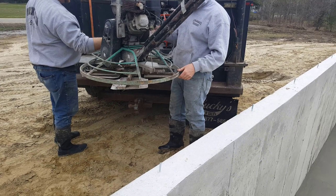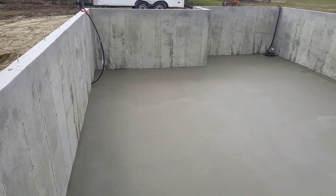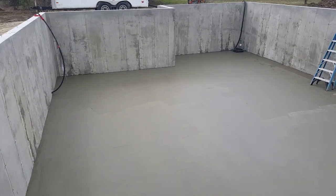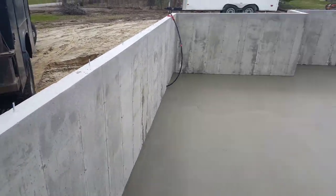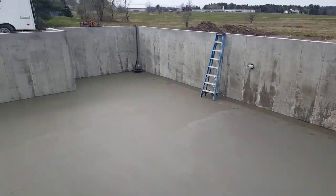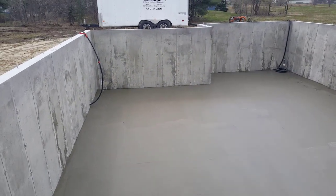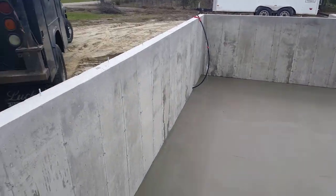The reason we use float blades is it's easier to get out any rough marks on the floor like bull float lines, and it helps flatten the floor out better than just using finish blades or combo blades. The float blades are kind of like magging the edge first but doing it for the whole floor — they fill in those bull float lines, fill in any rock holes, and take out any little bumps or dips. It really flattens out the floor well.